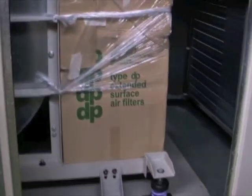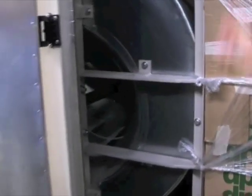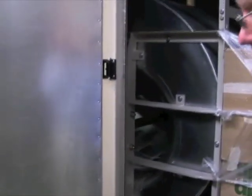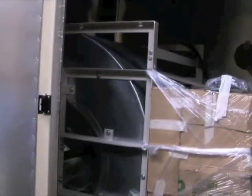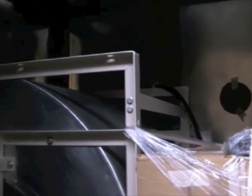This year we added external lube lines so that the lube is run all the way over to the outside door. We also added a viewport so that if somebody wants to see if the fan is spinning in the right direction or if the belt is flapping, they can actually view that right through that access door, which is covered up for painting right now.